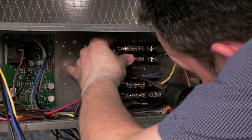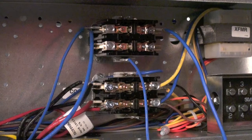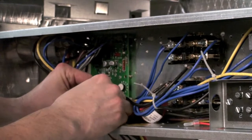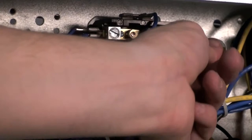In the control box, install the heater contactor with two screws. Mounting holes have been pre-drilled. Connect the conductors to the heat contactor as shown on the wiring diagram. To access the rear of the voltage terminal board, remove the screw at the lower right corner of the board. Bundle any loose wires in the control box with wire ties. Place the HC decal next to the heat contactor. Check to see that all connections on the heater assembly and the contactor are tight and secure.